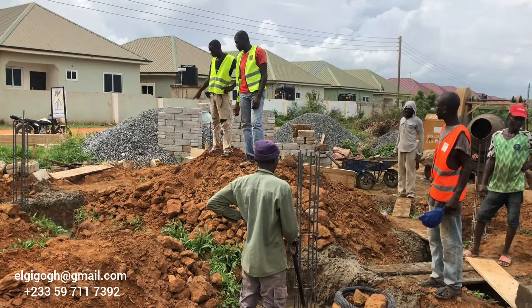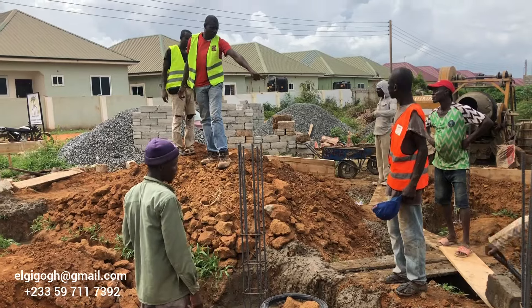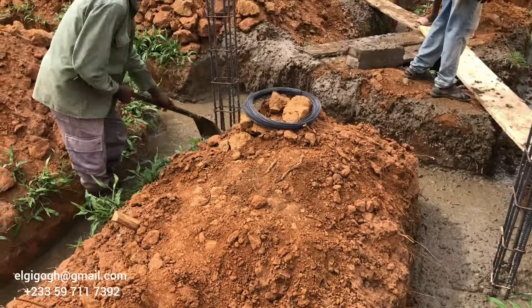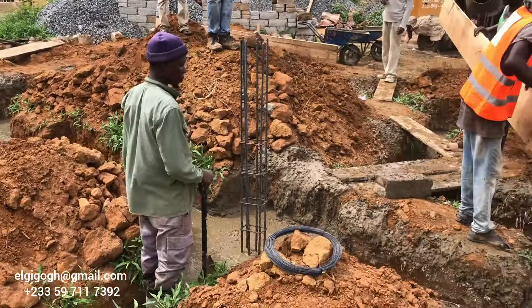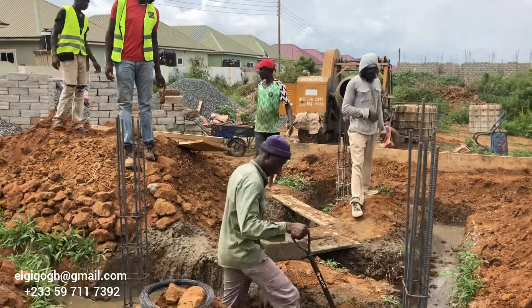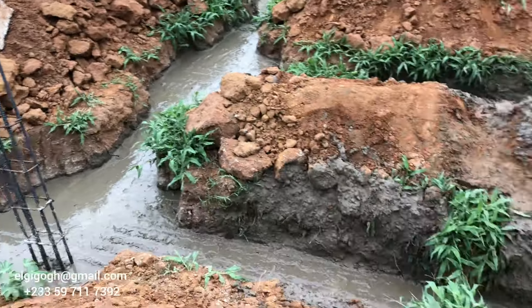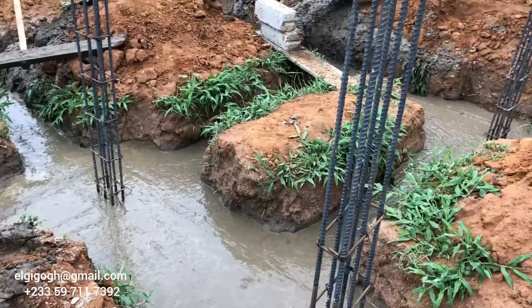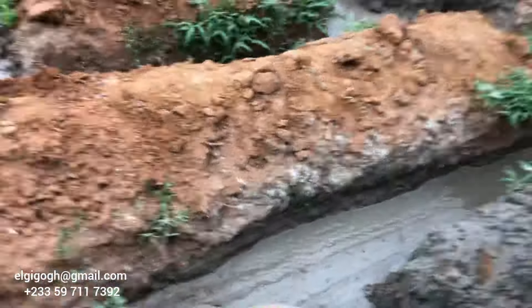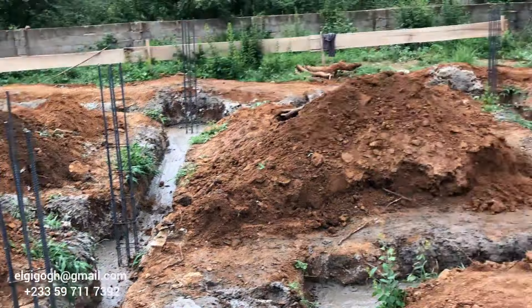The house has to sit on the concrete, not on the ground itself. If you look at videos out there you will see how little concrete some people pour into the trenches. You can see ours is almost getting full. Don't just listen to what we are saying — watch what we are doing. You can see the color of the cement, the gray color. Compare it to other videos where the color is brownish because they don't put in enough cement. Pay attention to details.